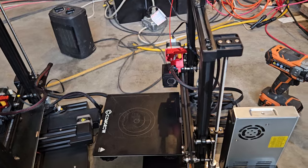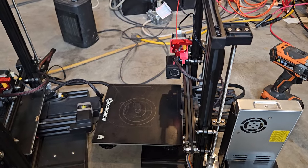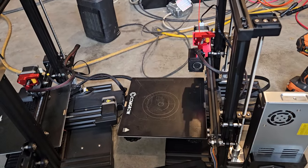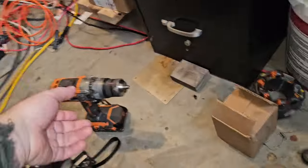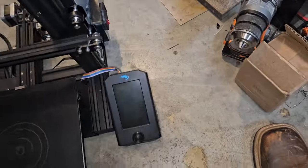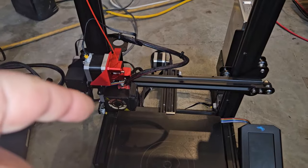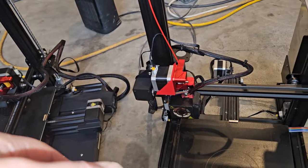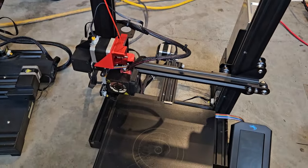The touch sensor is great. The bed leveling on the Neo with the stock software is really good — the factory firmware and auto bed leveling work absolutely great. This one has BL Touch, this one doesn't have anything, and both are running the professional firmware. The tramming wizard on this one works really really well with the touch sensor. Without it, it's a pain — you're going to make four adjustments over and over before you get it really close.